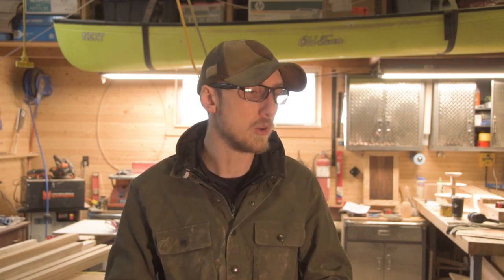That really is just a big part of the fine woodworking aspect, because now that I have all these pieces milled, I need to very quickly get on to cutting joinery. In the next two days I need to have all the joinery cut on these before they start moving around and doing stuff I don't want them to do. The sooner I can get these pieces together — or at least get the joinery cut on them — the better off I'm going to be in the long run. The clock has started to tick on these pieces.